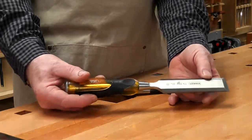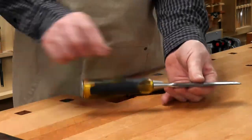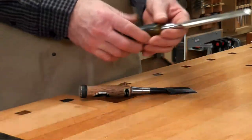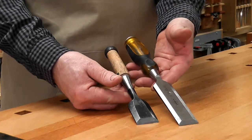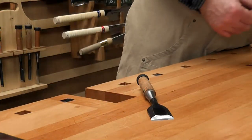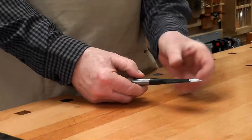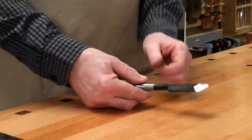I've been to places where I've looked at it and I think, wow, you machine that from a round bar and you put a pin up through into the handle. They're a bit crudely made in ways, but the chisels, they all do a similar job. So what makes a Japanese chisel different to our Western one? And why would you maybe want a Japanese one over a Western chisel? First of all, with it being shorter, it's actually more control. You're a bit nearer the workpiece. Downside to that, the length of overhang of where you can cut into.